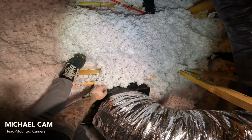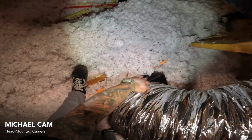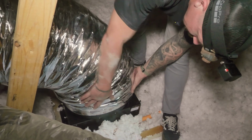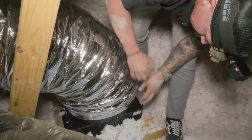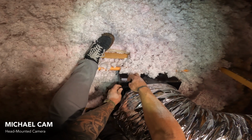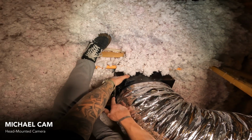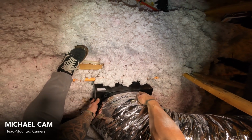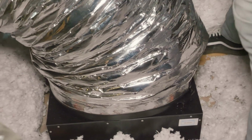So you want to get one end of the duct collar a little bit of depth on the collar of the damper box and then work the slack over to the opposite side and then push down evenly? Yeah, you pull the slack towards you and then get the duct collar over the damper box collar. Once it's on, then you square it up and snap the collar down square. Okay. And then I see that buckle clasp that we used earlier. That's ready for closing? We're going to bring this slack back or adjust this out if we're on a corner. You snap it to the receiving edge, pull it, and you can see it sucking the slack out, and it snaps itself closed.